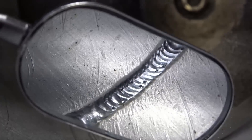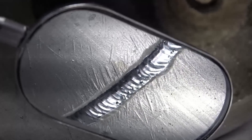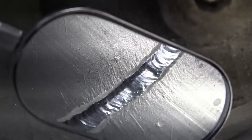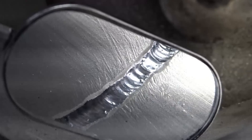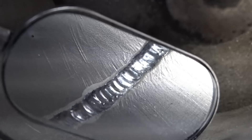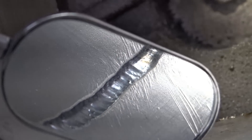Like I was saying about the cleaning action and the etching zone — if you look at the weld here, the cleaning zone appears a little bit darker. If I shine the flashlight differently, the etching zone will appear lighter. So the weld changes depending on where I shine the flashlight. I was fortunate to get this shot of the weld on camera — we're looking through a little inspection mirror, a tiny little mirror — just to get the closest shot I could get of the root pass.